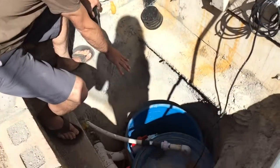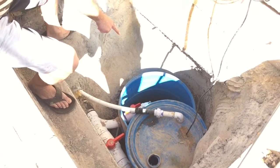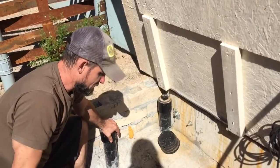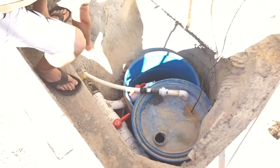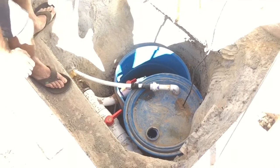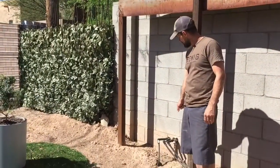We're going to put it right from the tank into the backyard. This surge tank is just designed to hold a surge of water — it gets immediately pumped to the backyard. I'll have a demonstration of what that looks like when it's pumping in just a minute. The gray water comes into this tank and is immediately pumped into the backyard with this pipe here — just a piece of PEX flexible pipe connected directly to the pump, going out into a manifold in the backyard.